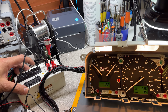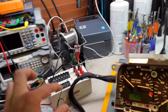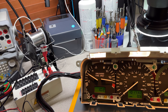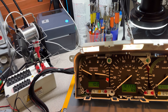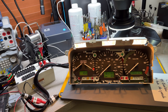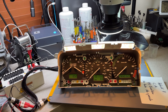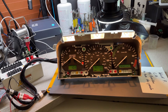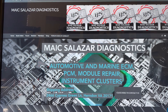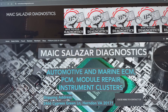I'm going to put more RPMs — I'm going to go to 2000. That should be 100 hertz, and that is exactly right; we can see the response is immediate, so that is good, and it resets perfectly. I can turn the speed off. Let's double check the temperature: I'm going to increase the temperature, and we will need to see this light blinking — that is like overheating or a low cooling message. So that should increase, and it is happening, and we can see the needles going up. The one in the temperature: perfect. And now the fuel — that is good.